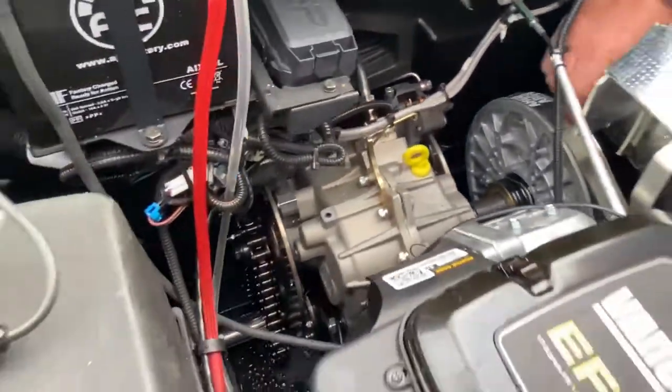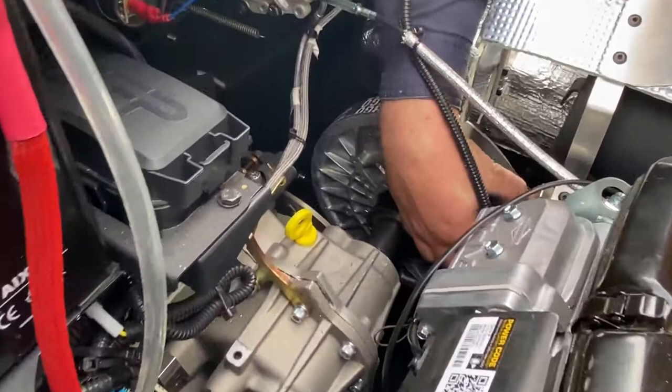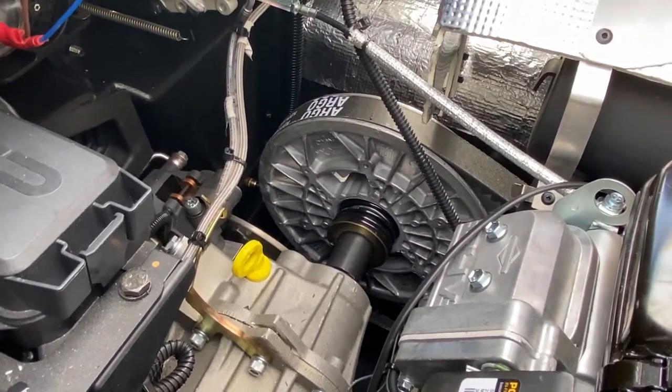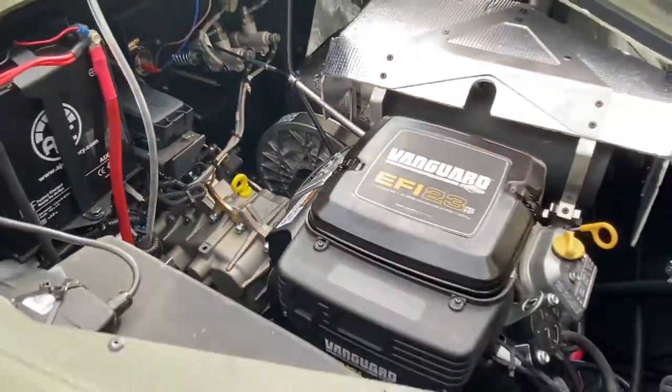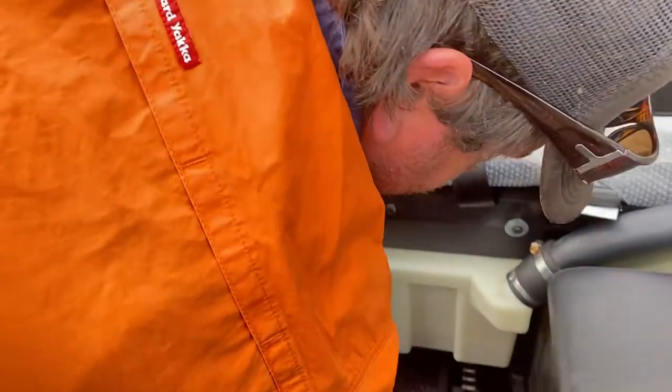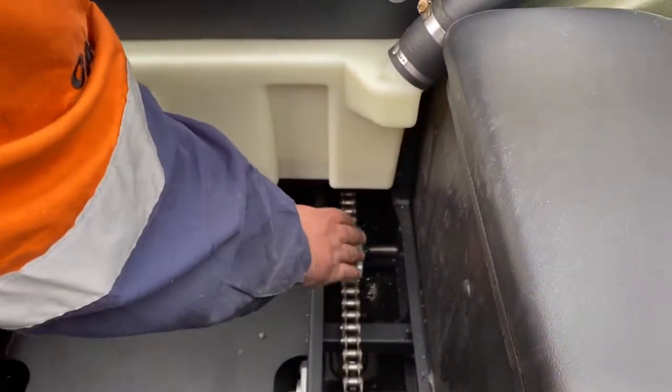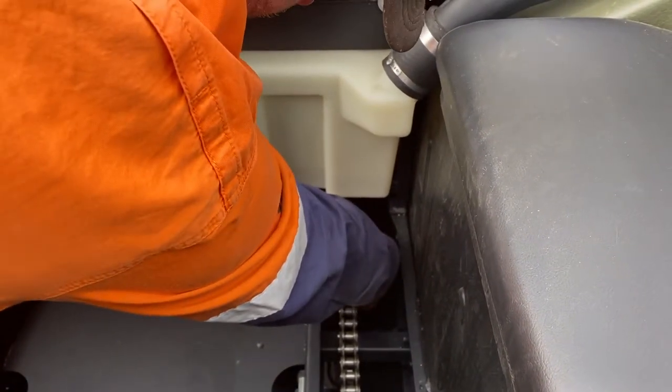We also keep an eye on the belt to make sure there are no foreign materials and that the belt's not showing any signs of wear. The rear chains have an adjuster on them and they're supposed to be self-adjusting, but if they fill up with a bit of dirt, you may just have to flick your hand under them.